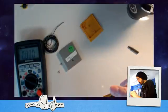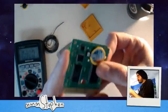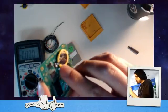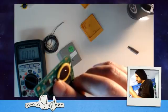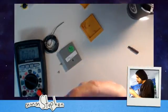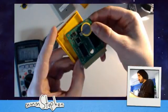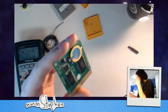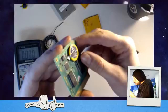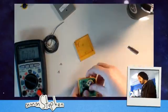This one is super weird. That's definitely someone did this. That's not a factory solder. And see all that grime there? The flux inside the solder bled out a lot. That's really gross. Also, it got super wet at one point in the top left corner, and I can't see through these glasses because they're bad. But yeah, there's a ton of oxidization there. Step 1. Does this game light up?